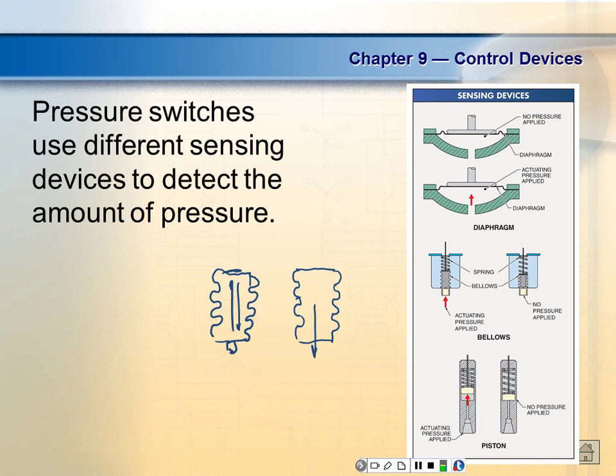Bellows work against what we call a calibrated spring. Springs can be very accurate in how much they compress and expand. For years people have bought and sold off scales that use calibrated springs. Speedometers on cars used to work like that too — they worked off calibrated springs. The needle had a calibrated spring and two spinning magnets. You literally ran a cable up into the back of your speedometer that was spinning off your transmission.